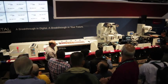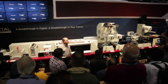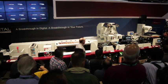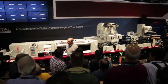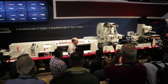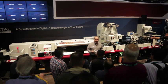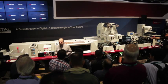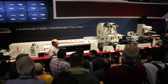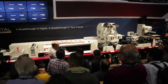There you see Alfredo is printing his favorite flavored beer label, and we're showing you the power of digital white in addition to the other colors. This is a really fantastic-looking job — you can see samples around the corner. Let's recap what we just did: we started with that meat seasoning label with a cold foil border, then showed you the hybrid power of printing metallic gold in conjunction with digital graphics, then changed our roll stock to clear film to show you digital white. And by the way — Alfredo can queue up a SKU change without even stopping the press. No plates, no make-ready, not even stopping the press for that.